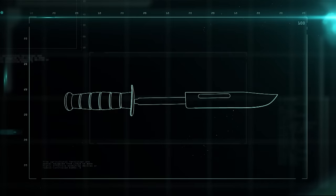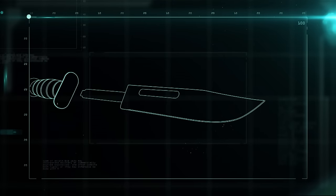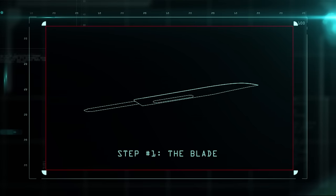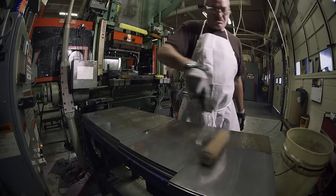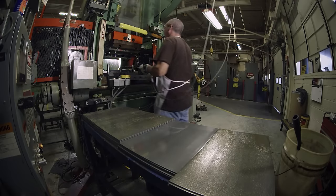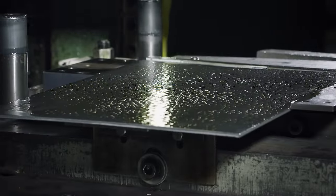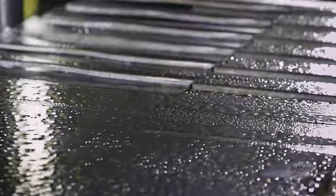The knife is made up of a leather-crafted handle and a razor-sharp blade of tempered steel. The first step in making the knife is to take a sheet of steel called chrome vanadium and coat it with oil so it won't rust. Then the 100-ton press punches out the blade. This kind of metal, used exclusively by Ka-Bar, is flexible and easy to sharpen.